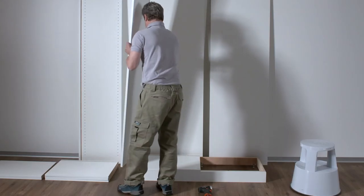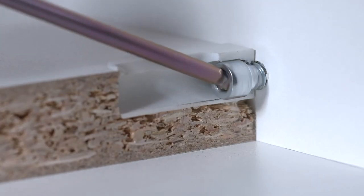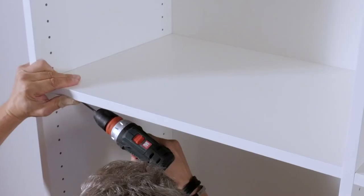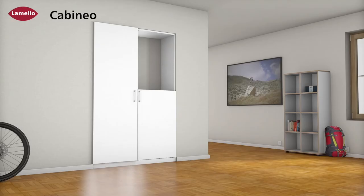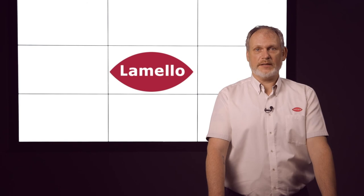The length of the screw is indicated by the collar: the black screw is 8 mm (quarter of an inch) long, and the galvanized screw is 12 mm (half an inch) long. Installing shelves after the cabinet is joined is no problem either. As you can see, after a few minutes and without much effort, the cupboard is assembled in its correct place.